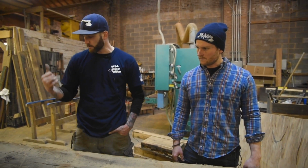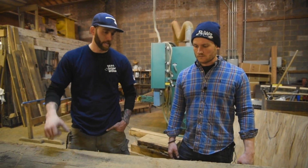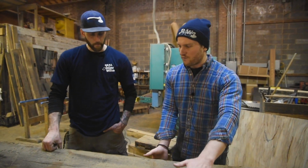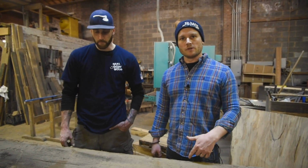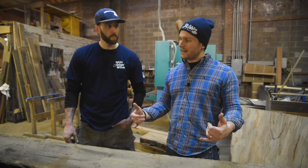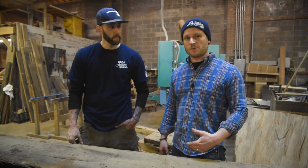We've got a big 16-inch jointer. We'll joint one side, thickness plane, rip the sides, and Domino them all together. Cool. So we're going to use like 4 or 5 pieces just like this to make that table. Exactly. Guys, stay tuned. We have another segment. When these come out of the kiln, we'll be revisiting it and showing you the next step in this process.